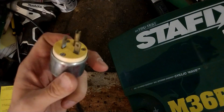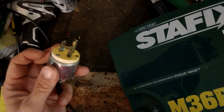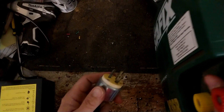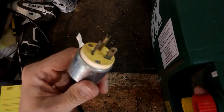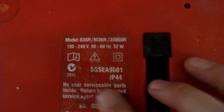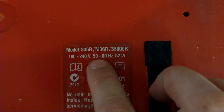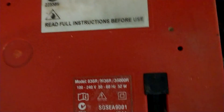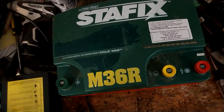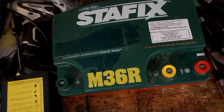When I saw the plug, I thought: damn, is there two different versions of this thing? Because I had already ordered parts — I ordered the 110-volt version because I didn't realize the plug was 220. But before I started calling and asking questions, I looked at the sticker, and it says 100 to 240 volt input, 50 to 60 hertz. So I knew right then that the boards in here can run off of 220 or 240. You just have to make sure your outlet is wired right and you have the right plug on there. We've got a power supply here for converting 120 to 240 volt, so we're going to hook it up and power it up.